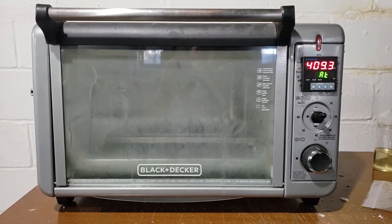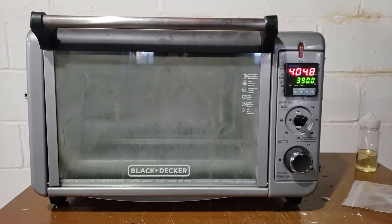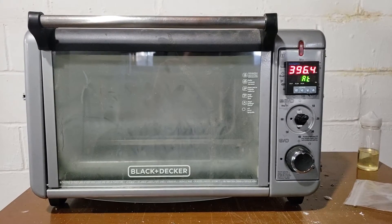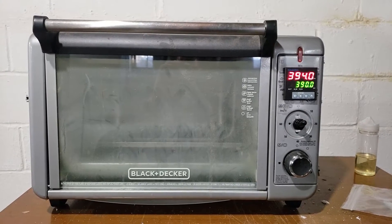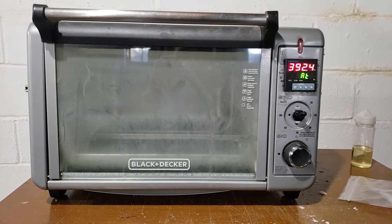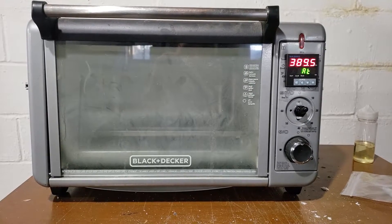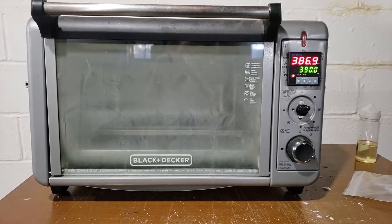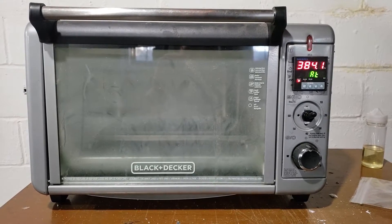The reason I'm doing this is for coating bullets — high-tech bullets need to be at a certain temperature to cure properly. My oven was just diving in temperature when I threw the bullets in, only hitting around 330°F, and by the time the bullets were done cooking — 10 to 12 minutes — it was only at 375°F. I did this just so I don't have to worry about that anymore.